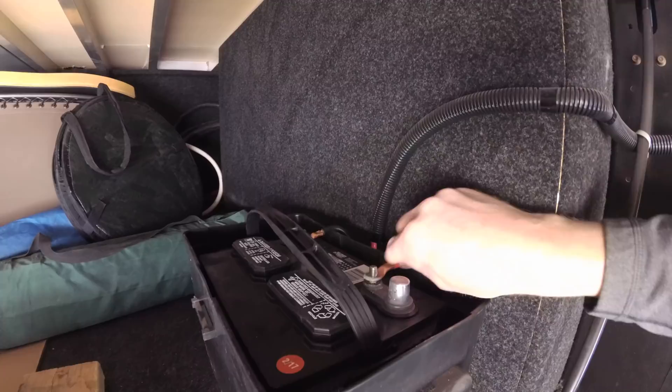Now I'm going to put the pump back on and make sure this is sealed up and not leaking. One thing I like to do is open this vent so it'll let off the pressure — that way the air is out of it and the water is filling up the hot water heater. When it's full, it'll start coming out right here, so we'll keep an eye on that. While we're filling up the hot water heater, I'm going to turn on the propane and see if it'll light. We have a propane hot water heater and an electric hot water heater — I'm going to turn on the propane one. One light comes on signifying that it's heating up. Let's go look outside and make sure it turned on.